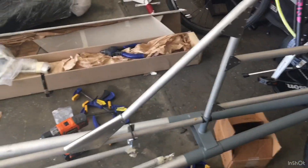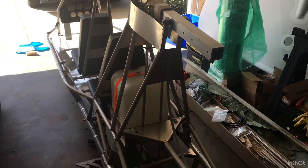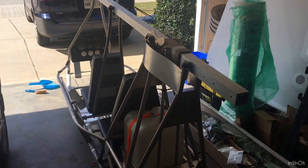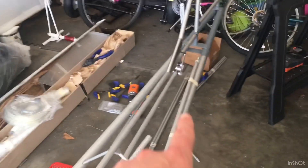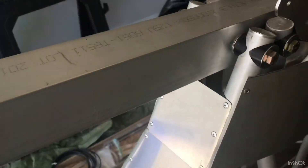I'm going to try to be less verbose on these videos. I apologize. The last two videos I made were all talk and not a lot of action — I'm just in the planning phases. I think since then I put on these guys, these former plates. They're called former plates. This is the root tube former plates, and then you've got former plates that go around there. I've installed these with just a couple rivets, stainless steel 42s. So that's going to be ready to cover with fabric.